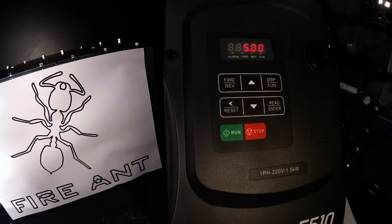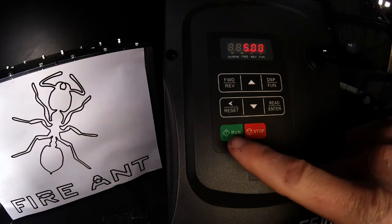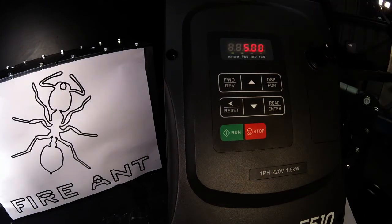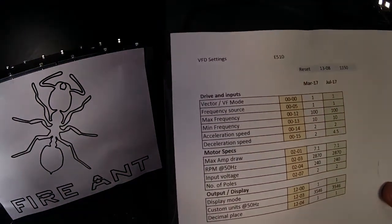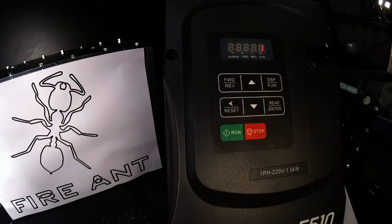The factory setting shows in hertz, so it's set up to run at 5 hertz. Using the dial does nothing at this point — that's something we have to change. If we use the start button it starts and it stops, so we know those buttons are working but the dial isn't. We need to find the setting for that. Go back to the very start of the menu. The first setting I want to change is 0000 — push enter, change that to 1. That changes it from variable frequency to vector mode. Push enter — it says 'end', meaning it's accepted that setting.